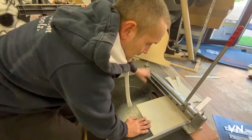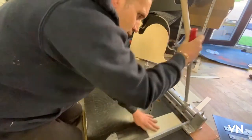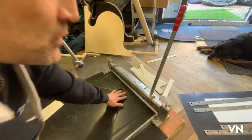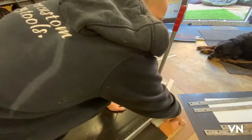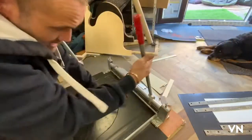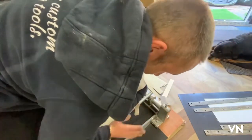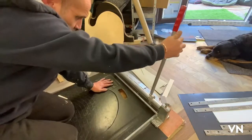You get the build-up in the back, whack that down, and as long as it's on that shear — oh, that's lovely. Remember: it's these two nuts either side of it. If you've got a wobble on it, undo these only a little bit, just knock it back into place if it needs to. As the blade's coming down you can see there'll be a tight gap along there — I've had to wedge something inside one of mine before. The further this way it brings the blade forward, but you don't want to overshoot that. As long as it passes through, you can see it.